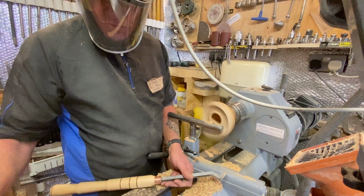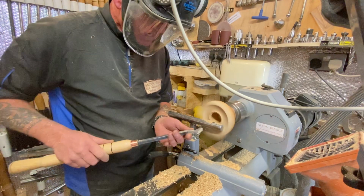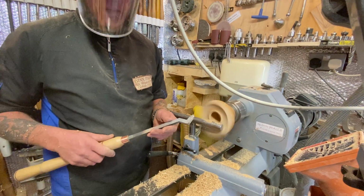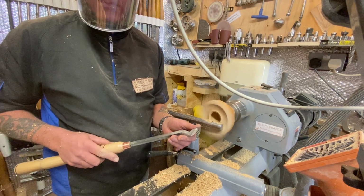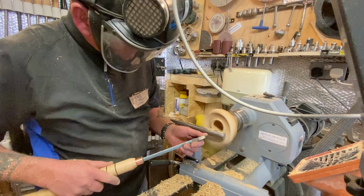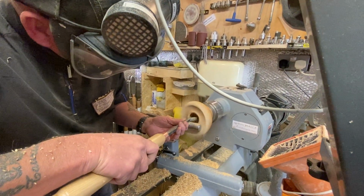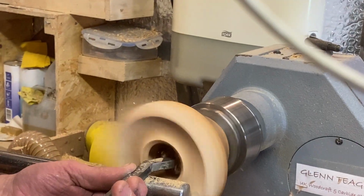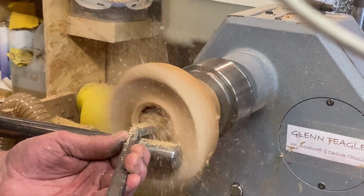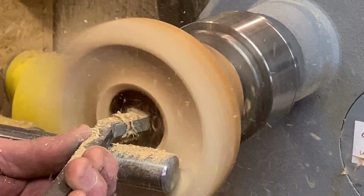But if you've got the standard GT hollower that I used to do before, that can be a little bit more grabby because it has a standard cut of flat. But I've tried it with a negative rake, and put a negative rake on there. I'm going to give it a try here, and the negative rake makes it a bit gentler, a bit softer. And look at that, it's not grabby. No grabbing.